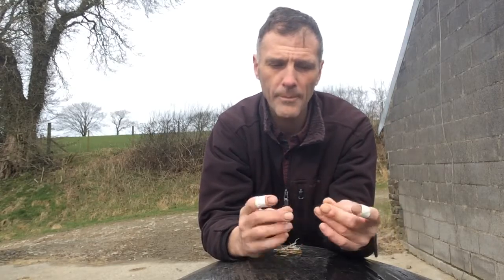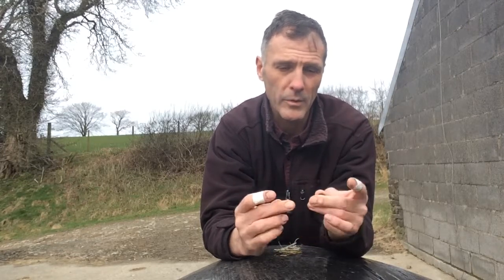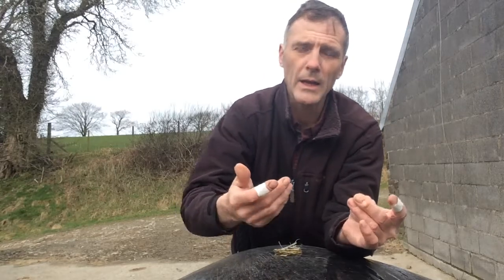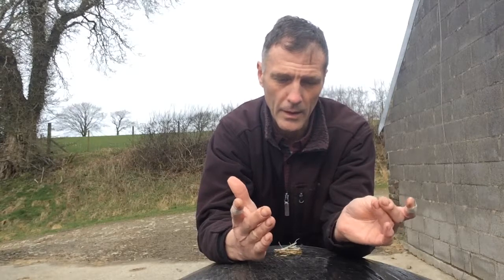In a bale survey conducted in 2012, where we visited 80 farms throughout England and Wales, we did actually take film samples, and we counted them in this way to assess the number of film layers on the bales. In actual fact, we came across a number of bales which were inadequately wrapped.